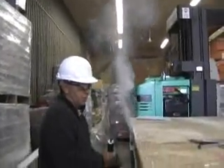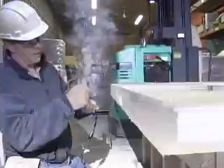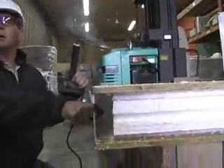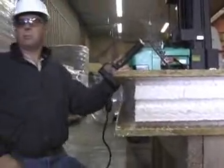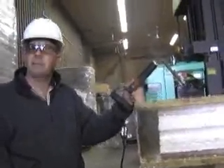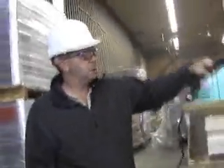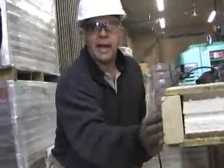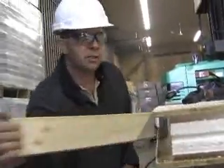The other thing you need to notice with this type of plate pocket cutter is the radius. That radius also translates to this right here. So when you take a block of lumber — maybe that small block of lumber behind you, Tony — remember to shorten a piece of 2x4? When we get to this point and we're going to put this in, without cleaning that out, this will stick proud — and it sticks proud because of that radius.